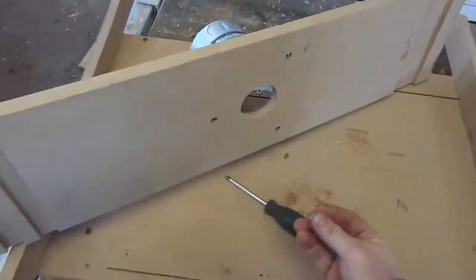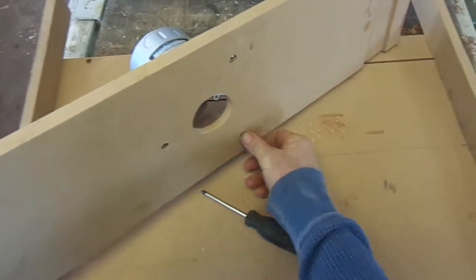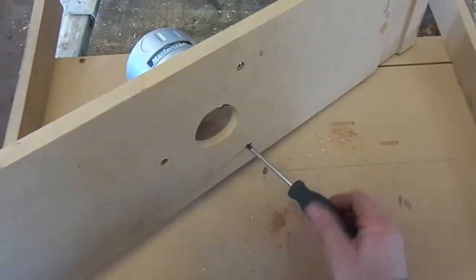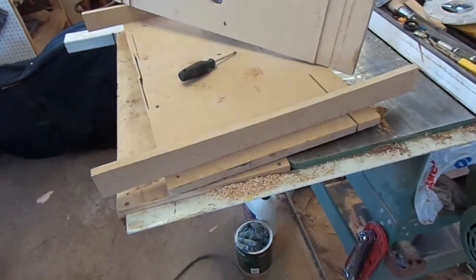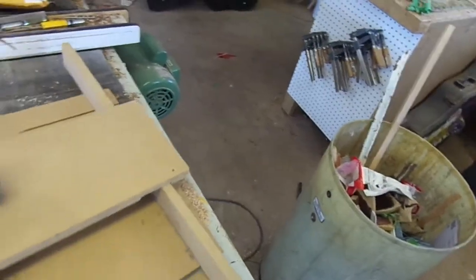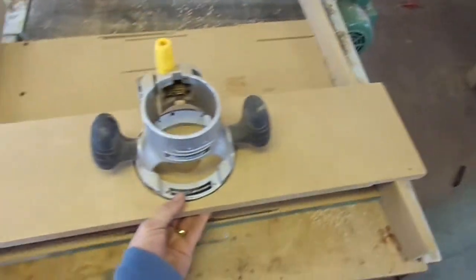So this is the jig. I'm just putting the screws in to the rudder base — that'll hold it in place. These are the runners; they're radiused, about 26–27 feet, though I think it's actually more like 22 feet. The rudder will sit on this and then slides on the runners, which give it the radius.